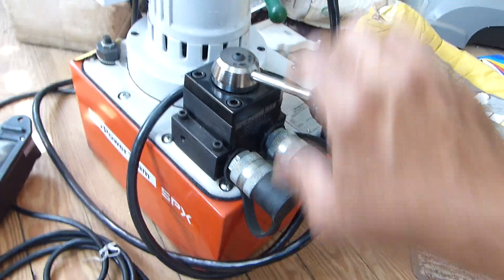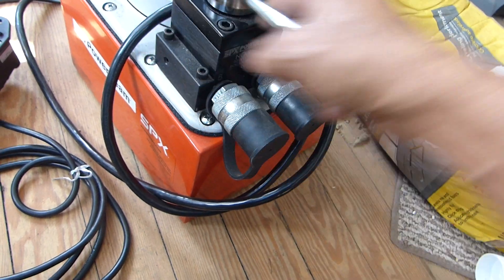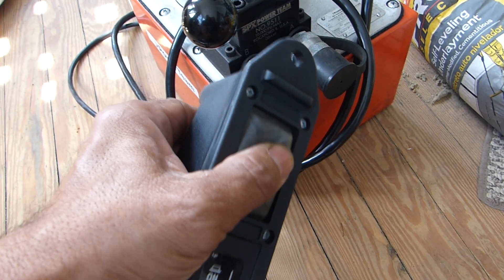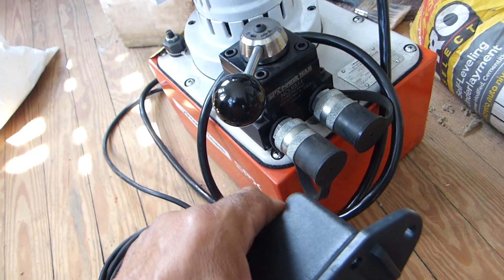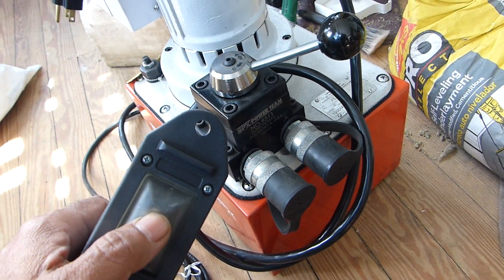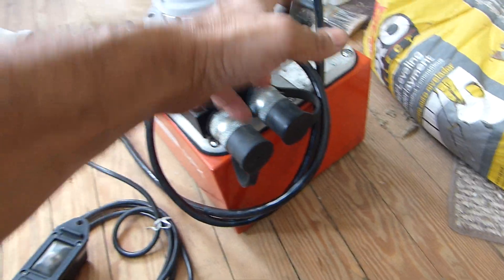Don't even have the hoses on it yet. So how do you do this? You've got an A port, B port — this is double-acting. You get to a safe spot, make yourself safe, you run your cable out, and you press your cable. You power up, and you're going to be A to B. Then you change ports to retract it and press again — all in a safe spot, a safe zone.